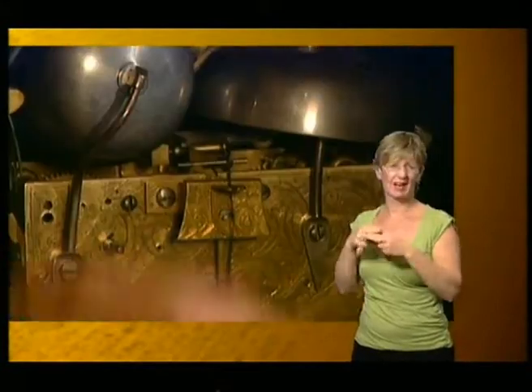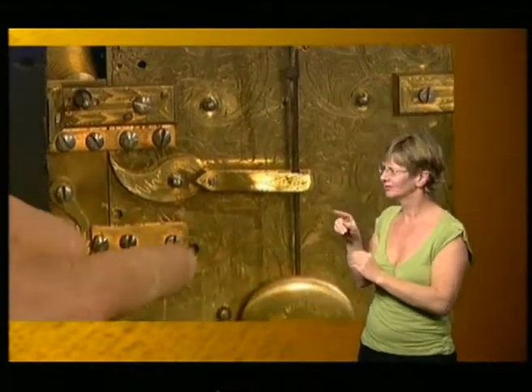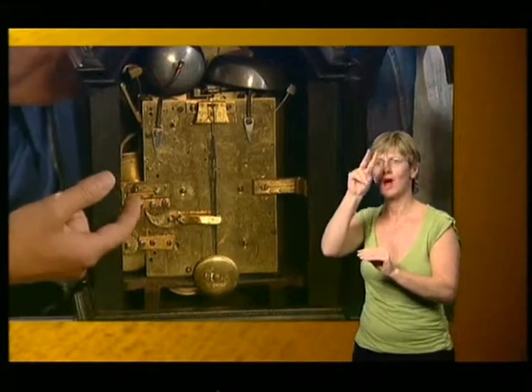Let's just lock up the pendulum and have a little look. This is the sort of thing the Victorians loved doing. Did you always remember it like that? No — I inherited this from my father, who had it from his great aunt, so it's been in the family for quite a long time. But when I received it, it had a large contraption on here. Because it wasn't working, I took it to a clockmaker and he mended it, but said they'd done a lot of harm by putting this contraption on. The barrel has been repositioned from there — where you can see that strange hole — to down there, and you can see the barrel hanging out underneath. They have bolted on this quarter chiming bit, which winds from the back.